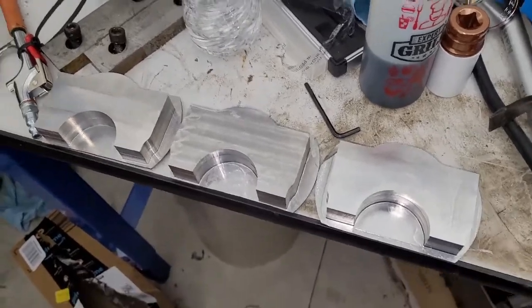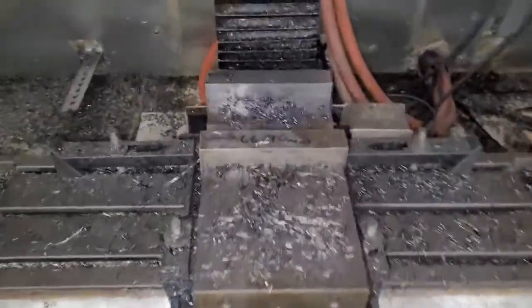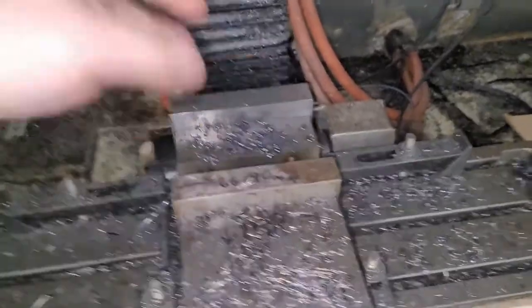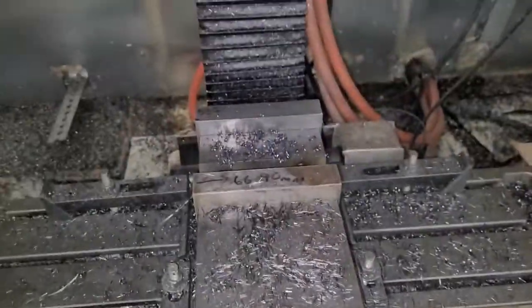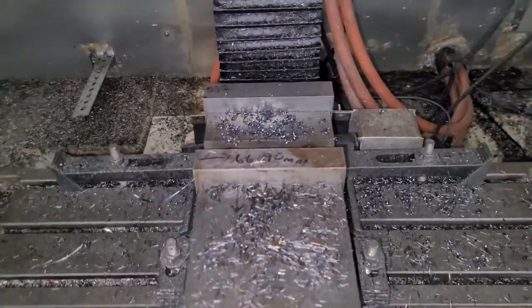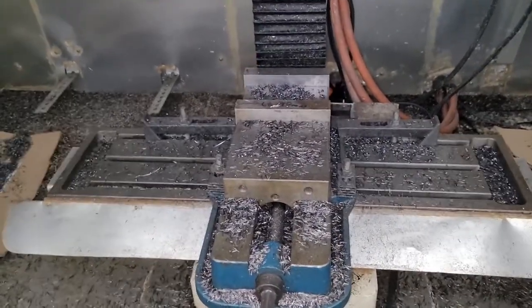The other thing is I need to be able to manufacture these parts without running into issues during manufacture. Essentially, here's the vise. Say I just got done making a part — I basically reach over here, take the part out of the vise, put the new part in the vise, take the handle, clamp it down, and hit the go button, and it starts machining the next part. And that's how it needs to be. It's got to be consistent — something that can kind of run on its own.